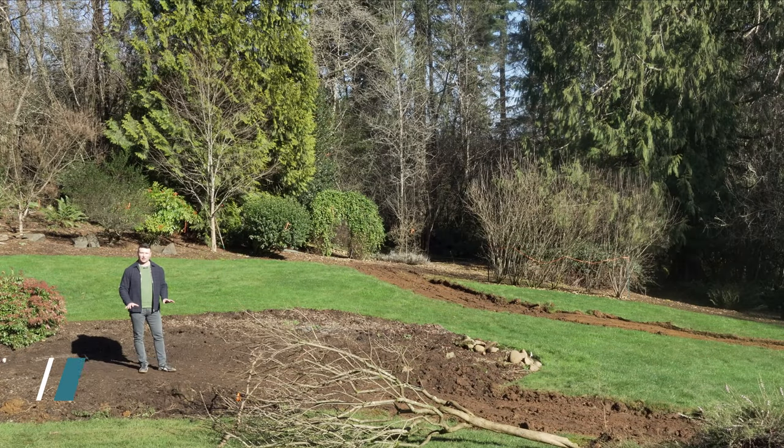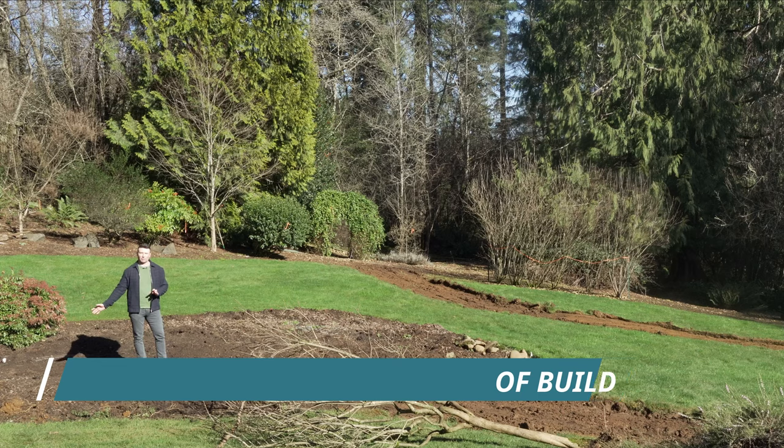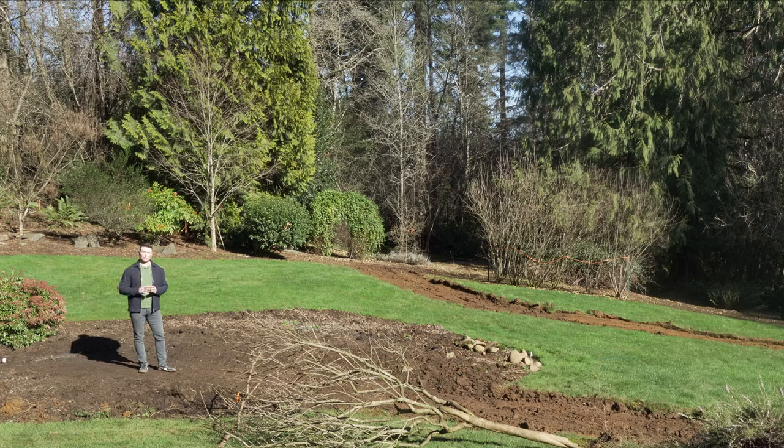What we're going to do here is a French drain — a three inch perforated pipe with a sleeve, which is the typical French drain we would use. We're going to hide that French drain in a beautiful dry creek bed in multiple spots, with destination plantings over that dry creek bed and pathways through the garden. It's going to move water nicely but also look very attractive.